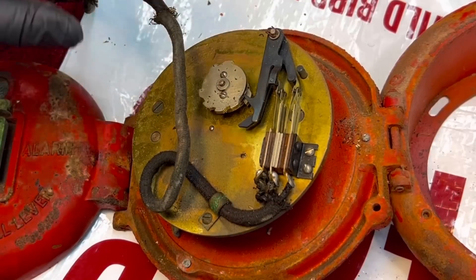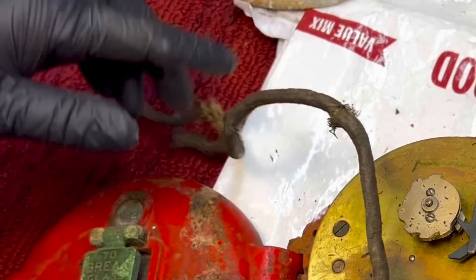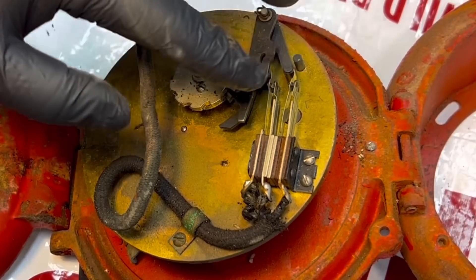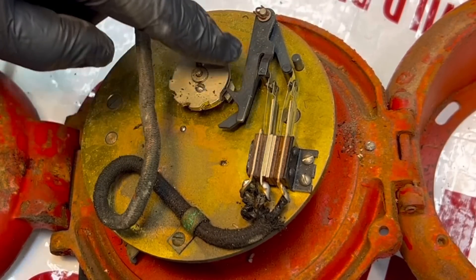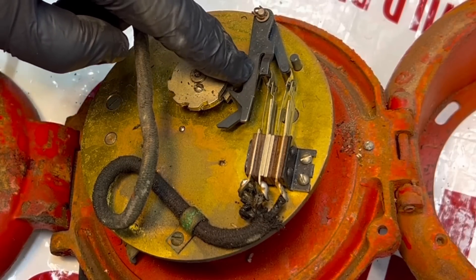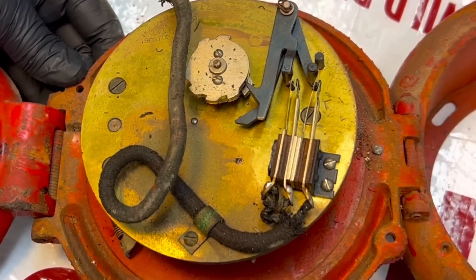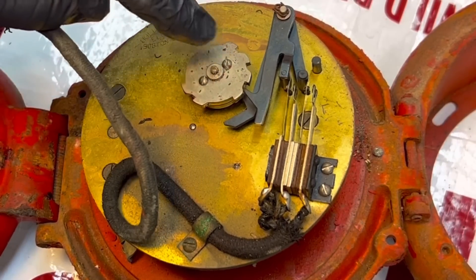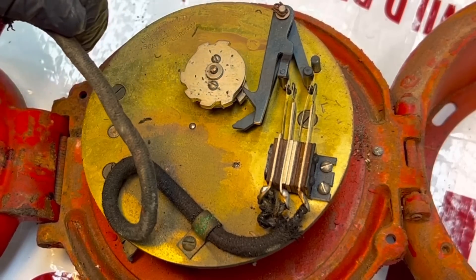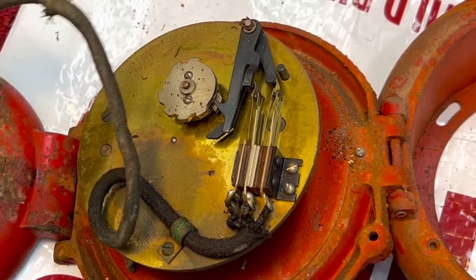Here's that clockwork mechanism — how interesting is this! There are four leads here. Probably a low current direct current would come in, and when this is activated it would close the switch, putting the current here. Remember I said this box is 42 — this little cog here will push this over until it says 42. I'll show you when we pull the handle down. There goes four — and there goes two. And it will keep saying 42 as long as the wind. That's just absolutely amazing. Simple and it works.